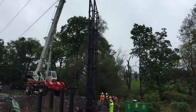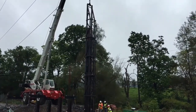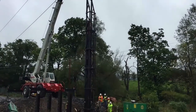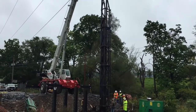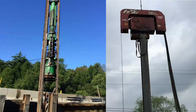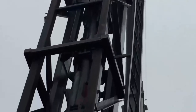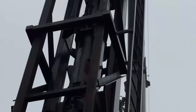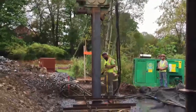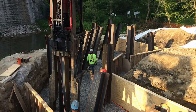In this video, we are going to discuss the pile driving process for structural foundations. Pile driving is the operation of placing a slender column into the earth by means of hammering or vibration to achieve a required resistance for the support of structural elements. Piles are used to support vertical and horizontal loading and come in many different kinds. There are two main types of hammers used to install piles: the drop hammer and the vibratory. The drop hammer projects a weight into the air and lets it drop onto the pile, creating the force needed to push the pile into the ground, and is typically powered by diesel fuel. Vibratory hammers use hydraulic fluid or another medium and shake the pile into the ground. For this training video, we will focus on the most commonly used piling operation: the placement of H-piles using a diesel hammer.